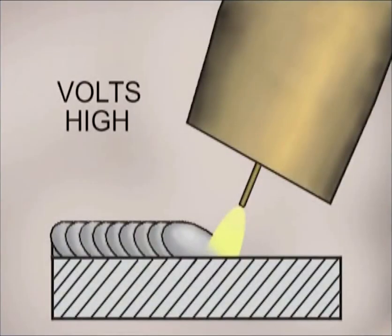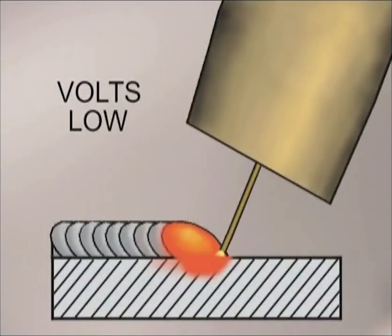As welder's skill in handling the wire feed gun increases, higher wire speed settings can be used along with faster travel speeds to produce the same amount of weld in less time. Once the wire speed is set, the voltage is adjusted to produce an optimum stable filler metal transfer. The molten weld puddle should flow out to the sides and be very controllable, with the finished weld bead virtually spatter free. If the voltage is set too high for the wire speed, the arc length is increased, putting more heat on the molten weld metal — the puddle is more fluid and agitated, making it difficult to control and causing excessive weld spatter. If the voltage is set too low for the wire speed, the arc length is shortened, allowing the wire to run into the puddle, and there is not enough heat to melt both the filler metal and the base metal, so the puddle doesn't flow out on the sides.